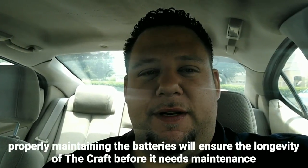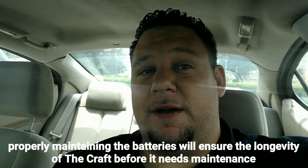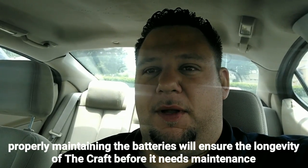So I just want to do a quick talk about storing the Gladius as well, because this is just a quick battery charging video, but I also want you to understand that lithium polymer batteries need to be taken care of very carefully. If you ever plan to store or leave your Gladius sitting, as with most LiPo batteries, you never want to let them just sit on a full charge for a long period of time. It will actually end up damaging the battery.